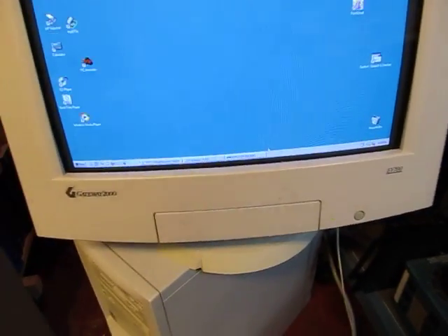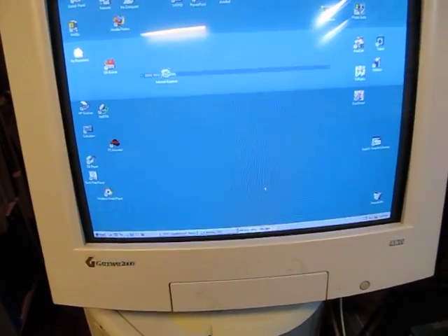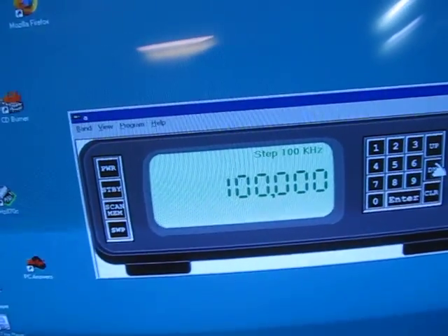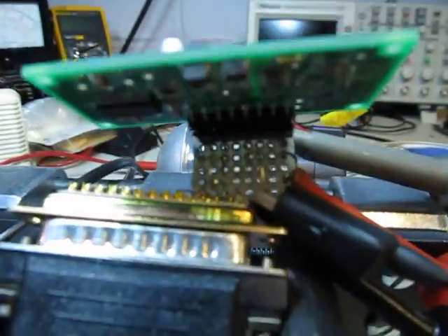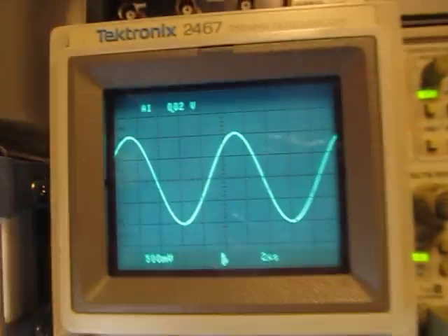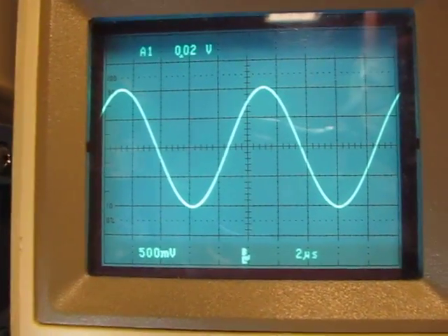So I'll plug it into the board, turn the power supply on — so now it's powered up. I've got a little control program on this computer here. I can just set up a frequency; in this case I'm setting up 100 kHz. So now that program goes through the little parallel port to write the control word to the circuit. We look over at the scope — there's my signal.